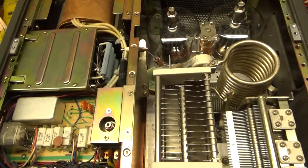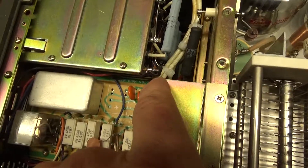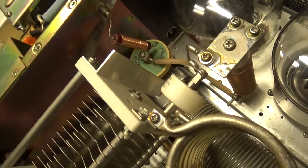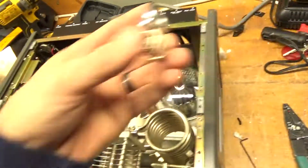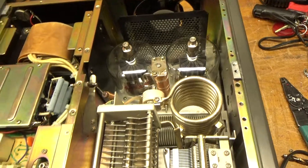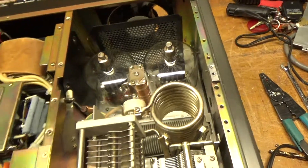While doing this video, I added a glitch resistor and a negative rail diode to protect the plate current meter in case of a short. I also reinstalled the plate choke bypass cap. I'm going to leave the stock parasitic chokes — I changed them on the 922 that I have documented on my website.